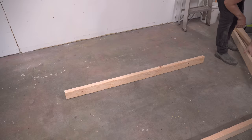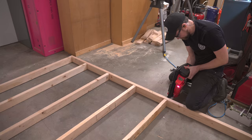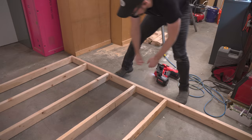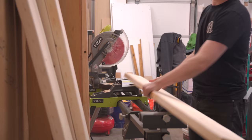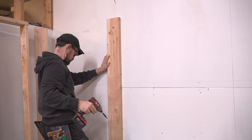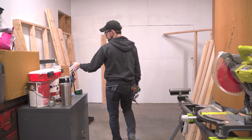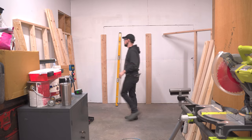The second side of the wall is the same as the first except a little bit smaller, and I'm leaving the top plate a little bit long — I'll show you why in a minute. When designing this room I was a little concerned about the strength of the ceiling, so I decided to cut down a couple of two by sixes to put against the back wall as structural support. These are going to act like posts to support that back edge of the ceiling. When framing I like to rely more on compressive strength than on shear strength — compressive strength is when you stack things on top of each other, which is always more reliable than shear strength.